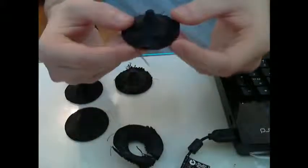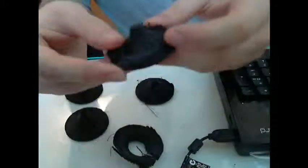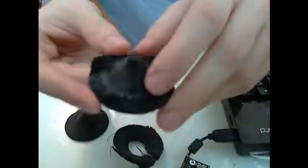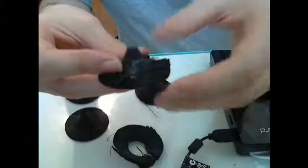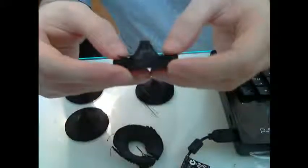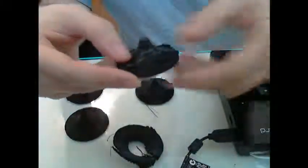The first thing I tried was incorporating the new interface layers I saw in the slicer software. The support raft is the zigzagging you can see here, and then the interface layer goes in between the zigzagging and the actual object to create a flat surface to print onto. It reduces the drooping that comes from overhangs — that's what the interface layers do.